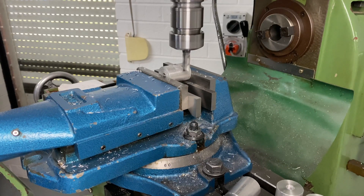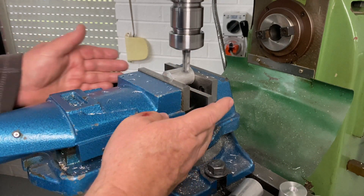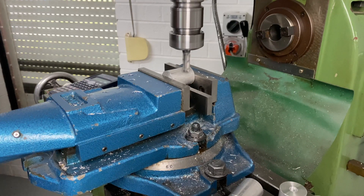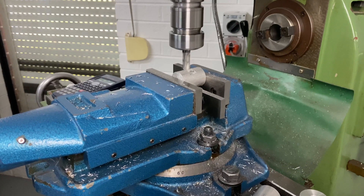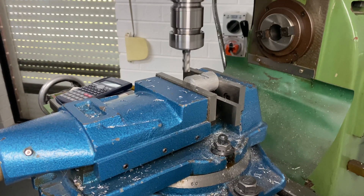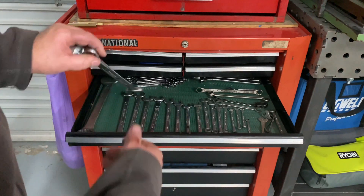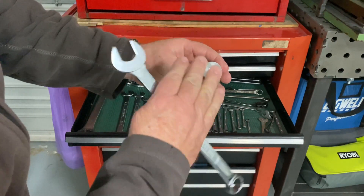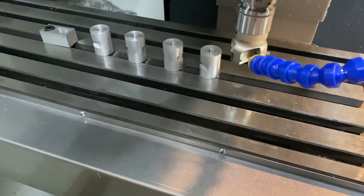I'm going to turn off the mill head now and flip that over to do the other side. I've taken out one of the parallels and just left one in, and that allowed me to sit it down onto that slot. I'll take another 4.6mm to get it down to my total width of 21mm and I'm just going to do this in one cut. The proof will be in the pudding — let's take out the 21mm spanner and put it on. You can see it's pretty good, I'm very happy with that. They'll allow me to lock it in the CNC machine and face the top to make sure I've got exact heights. I've mounted the standoffs in the milling machine via the T-nuts and tightened those up with the spanner.